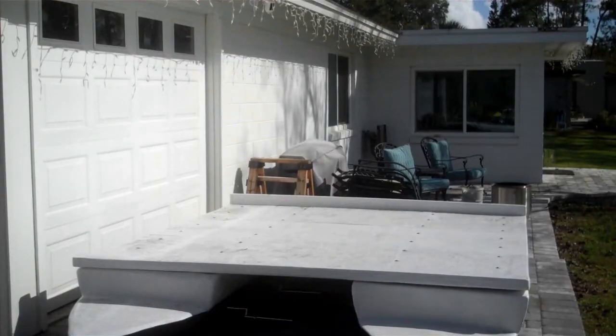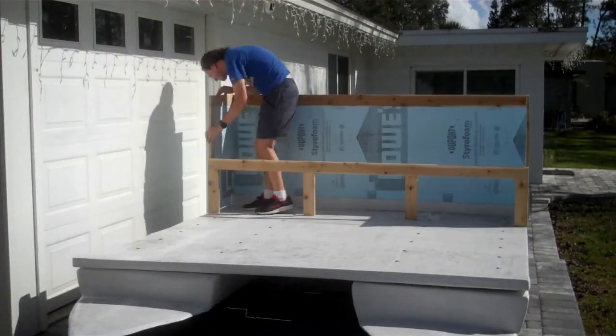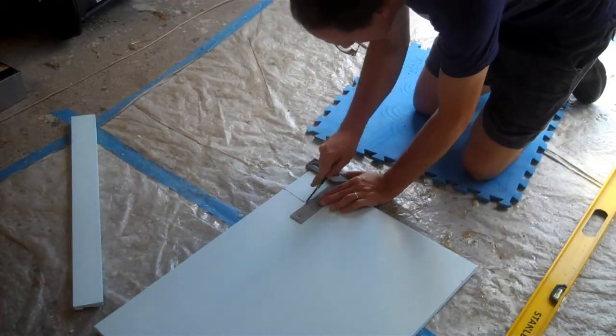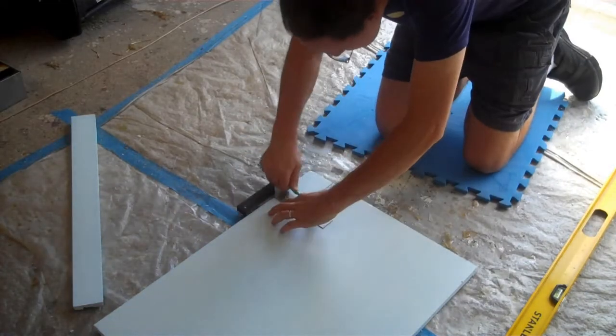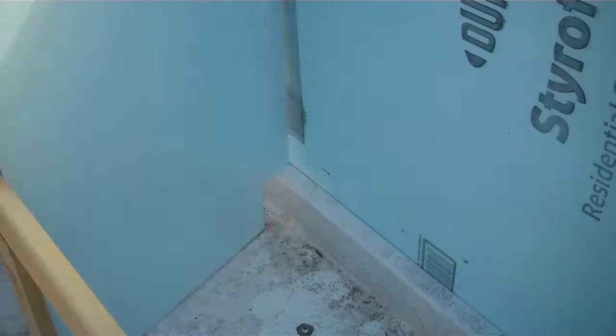After I glued the rear panel on, the outside of the bench seat is complete. I carried it back to the rear deck board so that I could measure and glue the interior uprights. Much like the front boards, each upright is measured off of the existing deck board to account for the curve in the deck designed to shed water.